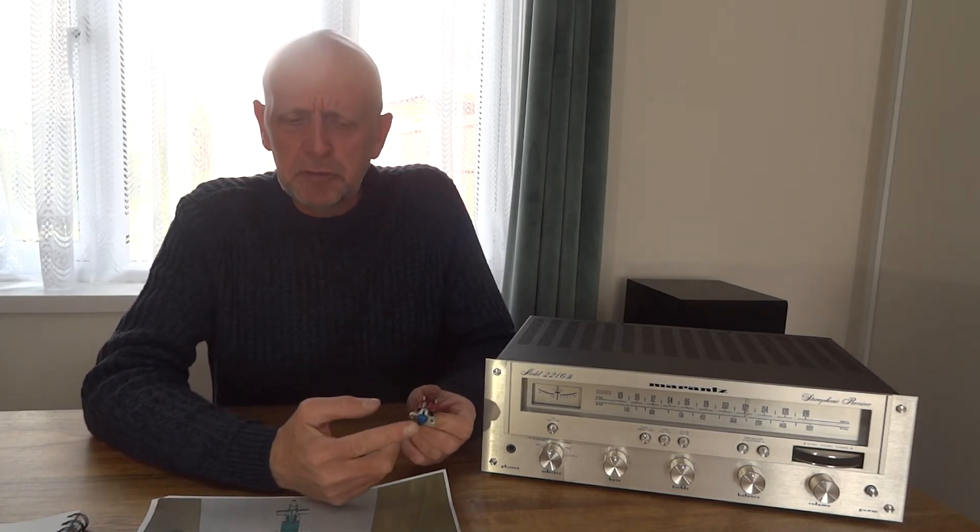Hopefully you got the idea from that. If you've had your own amplifier or receiver for years and then all of a sudden it gives a little bit of noise as you turn it on — a bit of interference, the lights dimming and then suddenly bursting brighter — that's the idea that something isn't quite right. I also pushed the switch in a little more while it was on and wiggled it about, and I could hear it wasn't making proper contact. Time to change the switch.